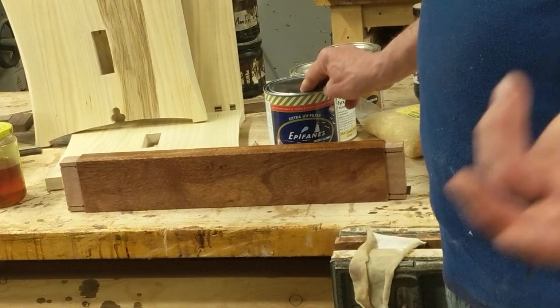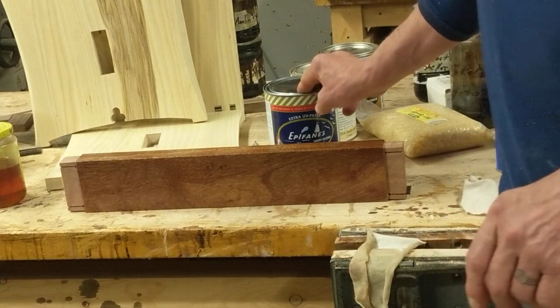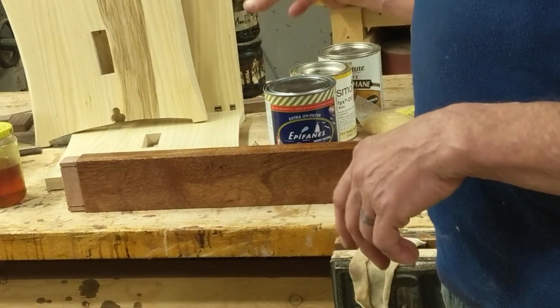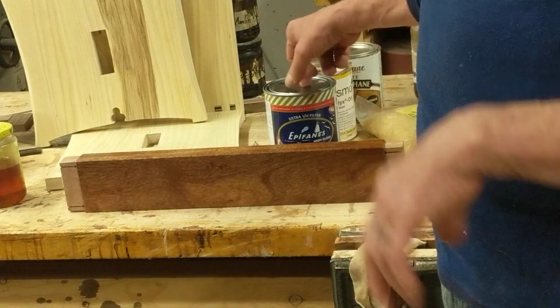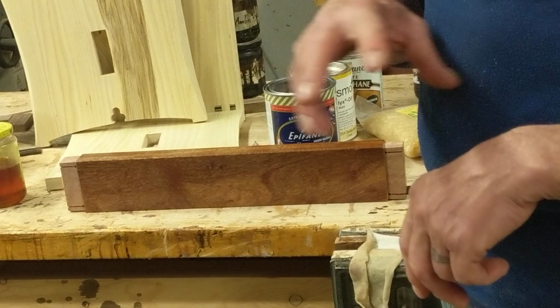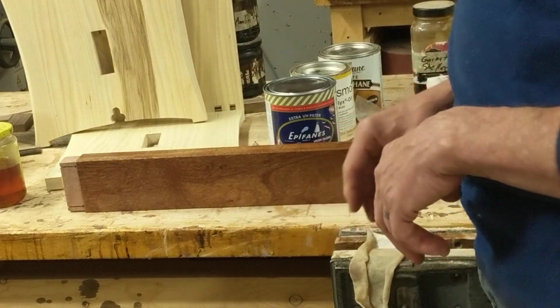So say for example I have one of the paddle boards, and I wanted less of that high gloss, really bright work type finish. I could do all my finishing with the gloss because it builds up faster, and then wind up taking that matte Epifanes and putting the final coat over top of it.